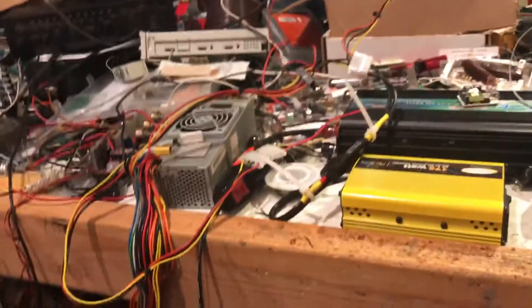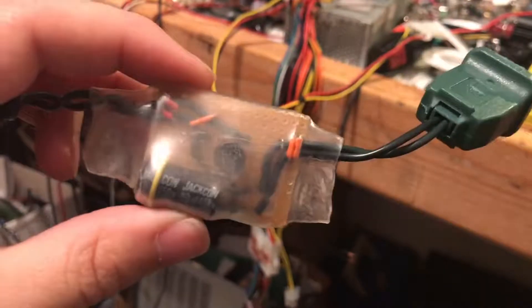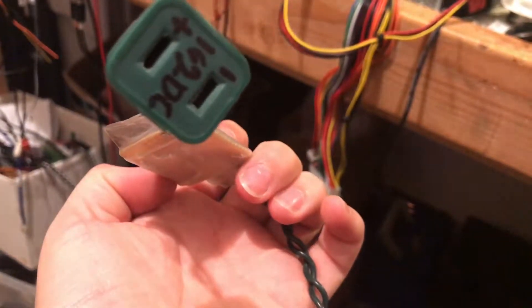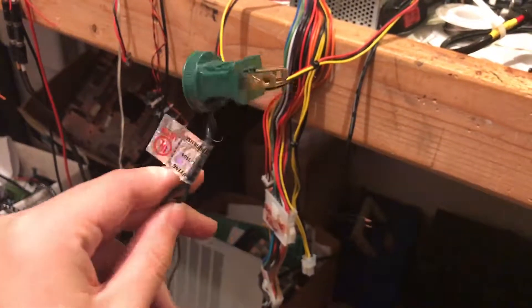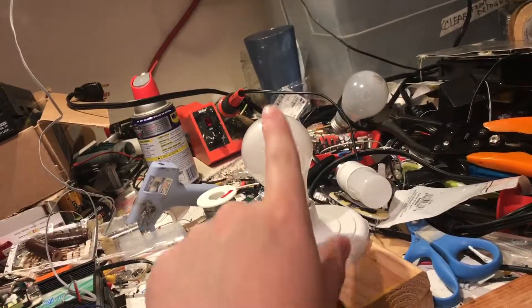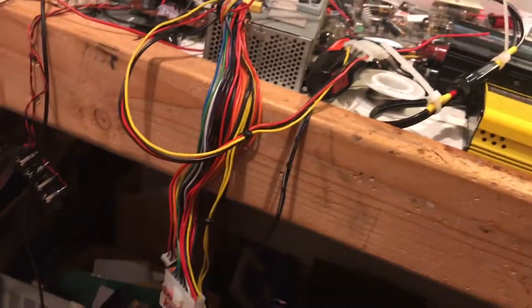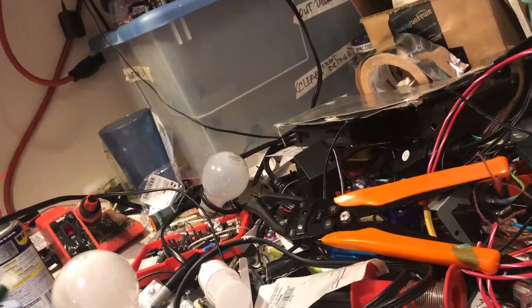Here's my very naughty boy — probably a little bit of an interesting thing. Full-wave rectifier, filter capacitor — there you go. 162 volts DC on the back end, and that just plugs into any wall socket. Same thing with incandescents — you can feed those DC and they will run just fine, they do not care. That's because these things turn into stroboscopic things on AC.